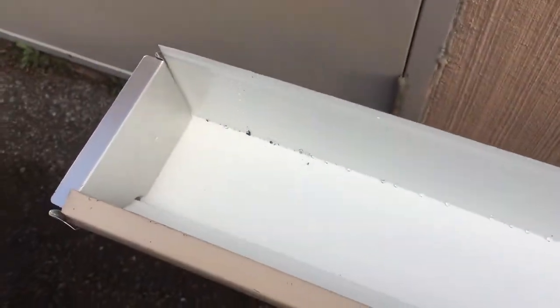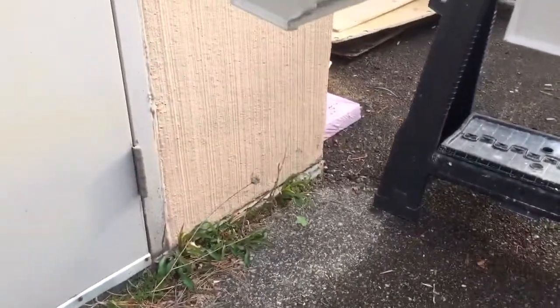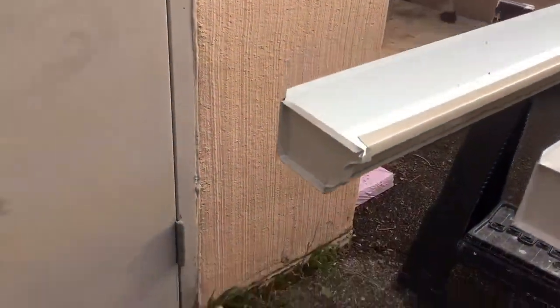And then on the inside, we will do the gutter sealant, a really nice thick bead, work it in. And that way I don't have to have any exposed screws or extra holes. I know a lot of guys use rivets. Some guys just pop some screws in there and a little bit of caulking, but I take my time to make sure it's pressure fit, really snug. And then with the added caulking, it's never gonna come out and you're never gonna have a leak.